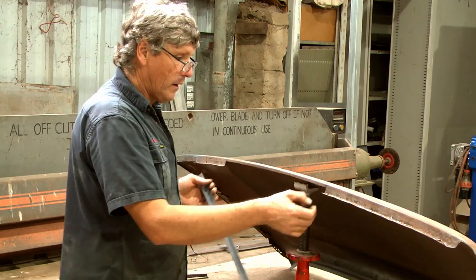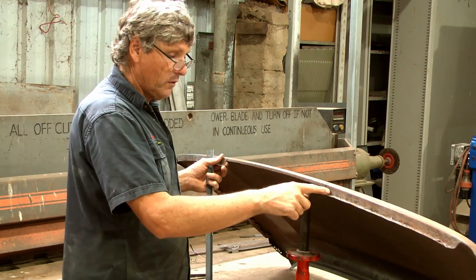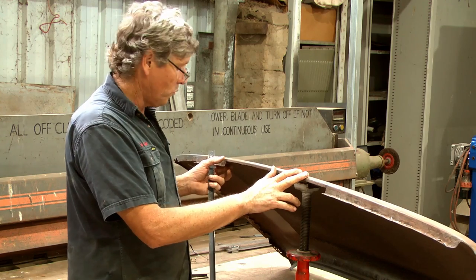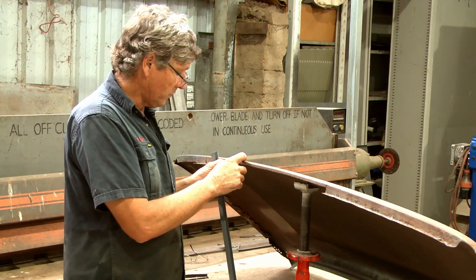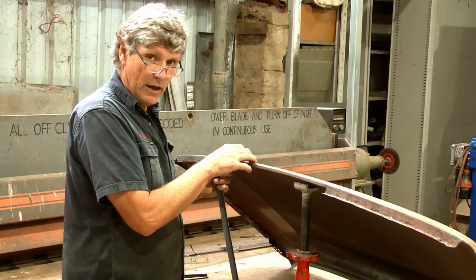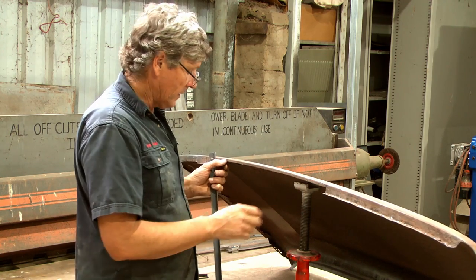And then we'll assemble it back up in the car, get all our screws in, and that'll hold the roof in the right shape. And then we should just be able to do an easy run across here with the welder. And given the nature of what it is, we will do smaller welds. So instead of doing our usual 20 millimetres, 3/4 of an inch that we can get away with on most panels, I'm going to bring that back to 1/2 inch or about 12 millimetres at a time, and we'll get all the tacks pretty close together before we actually start welding any of this.